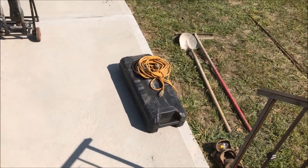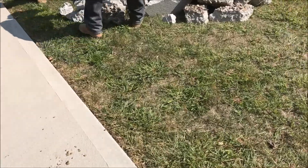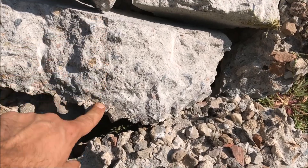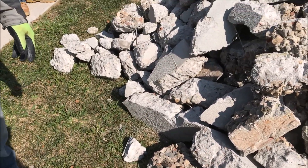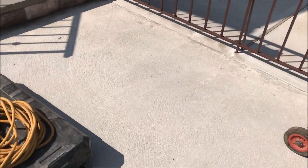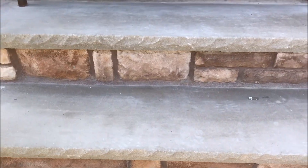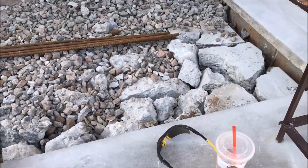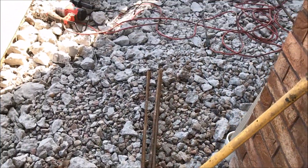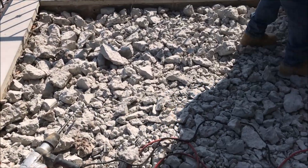This is a popular misconception: if you pour thick cement, it'll solve the problem of a poor sub-base. However, there's no amount of concrete that you can pour, no matter how thick, that will make up for a poor sub-base. What they did here was they just threw some dirt, threw some stone, didn't compact it, filled it in over two feet and just left it. This is why this slab failed almost as soon as it was completed.